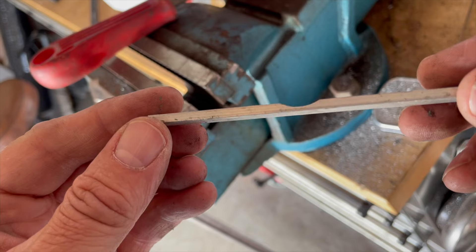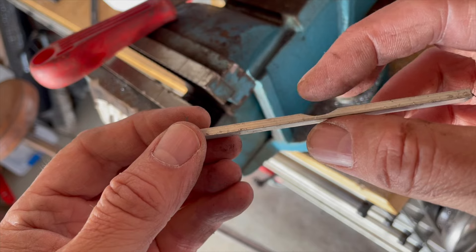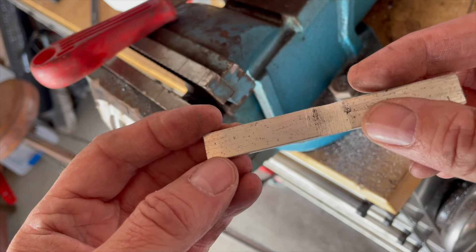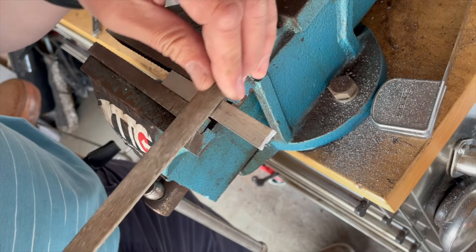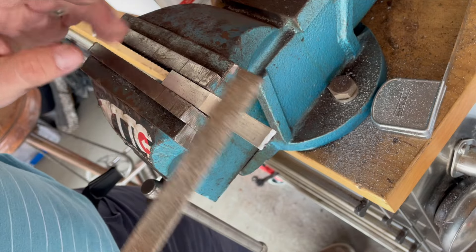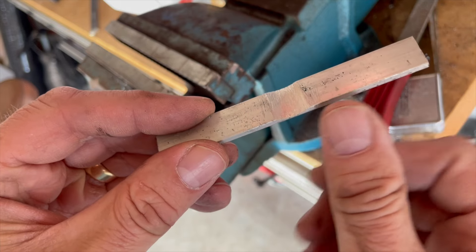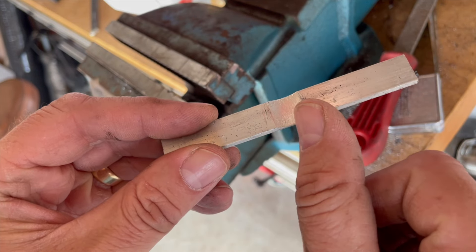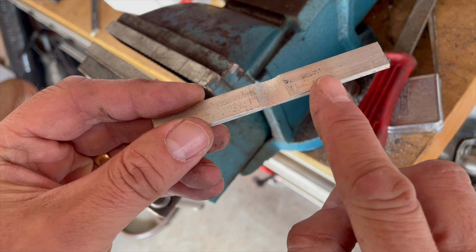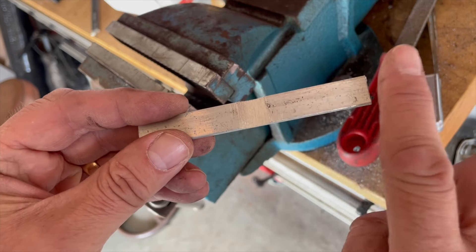I would suggest you want to go down to just reduce the thickness by just a little bit more than half. I'm going to go a little deeper, but only to smooth it off. It's about where I want it. Now what I want to do is about a centimetre from this groove, score myself a line on both sides, and then after that line taper this down to a really sharp point, taking off this surface.